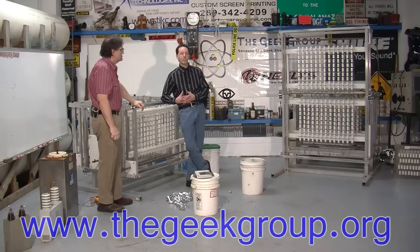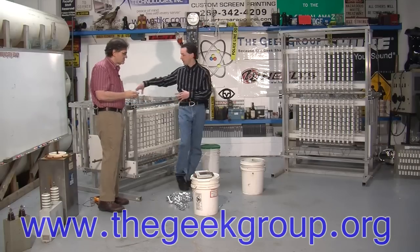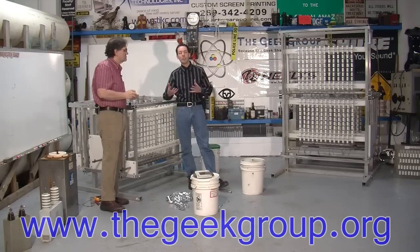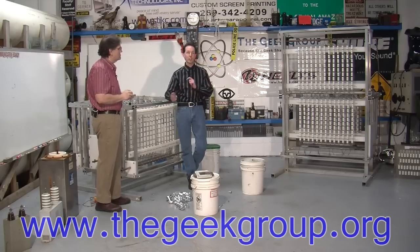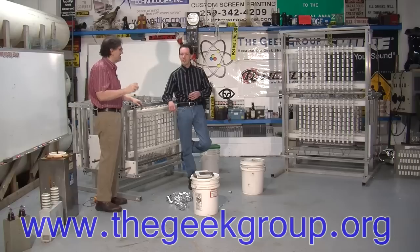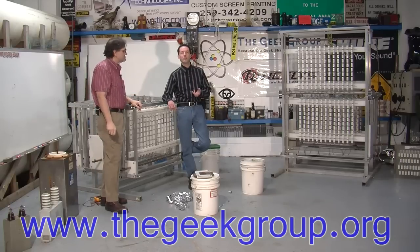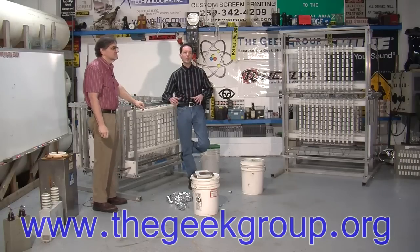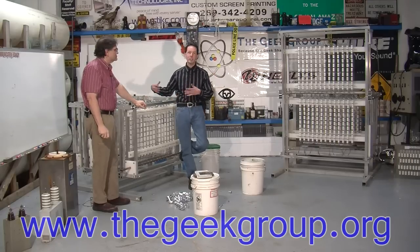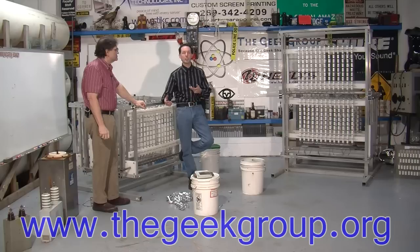We decided instead of putting it under oil, because if we had built this oil insulated, it could be much tinier. But it also makes it a lot more cumbersome to change the taps around easily all the time, or if you lose a cap, to get to it right away. Because of that we decided to go air insulated. So we wanted to make it big so that it can handle being dusty and not maintained very well, get a lot of abuse and get pounded on.